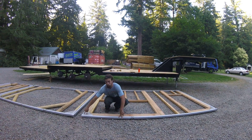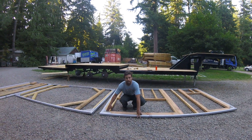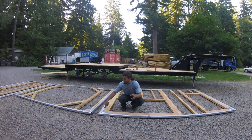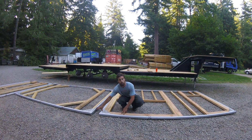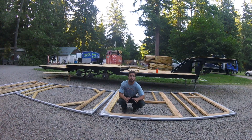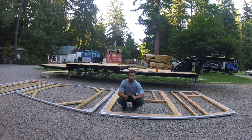We built aluminum structure frames around the walls with 45-degree gussets. We wanted to be able to weld the entire skeleton together and have doublers of aluminum on all load-bearing points, since this is a vehicle and we want it to have a lot of shear strength and be really sturdy.